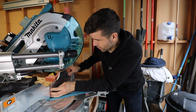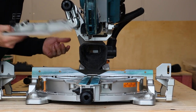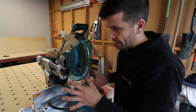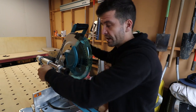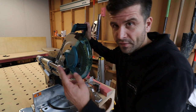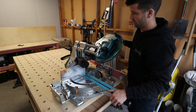For example, the fence — if you want to do a beveled cut, you know, slant the saw for an angled cut, you can't loosen this and slide it out. I've seen that on other Makita saws and always wondered why they do it like that. You have to literally take the fence off and put it in your tool bar to do a beveled cut. When I first saw this front knob I got excited thinking it was a bevel adjuster you could use from the front without reaching around to the back — turns out it's just for tightening the bevel once you've set the position. You still have to reach around the back, press a button, and go into position.